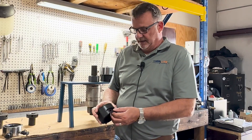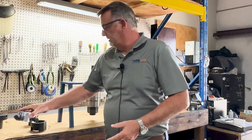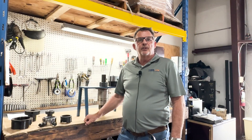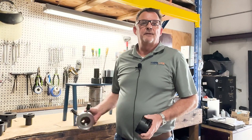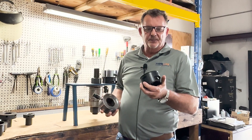Tensioners consist of four parts: the socket, the bridge, the ram or the head, and the puller. Both our manual retract and automatic retract tensioners come in sizes from three-quarter to five and three-quarter. Different stud sizes can be accommodated with the same ram — we just use different adapters.